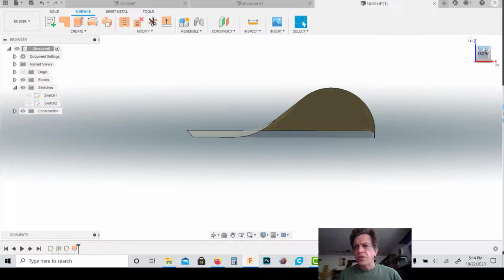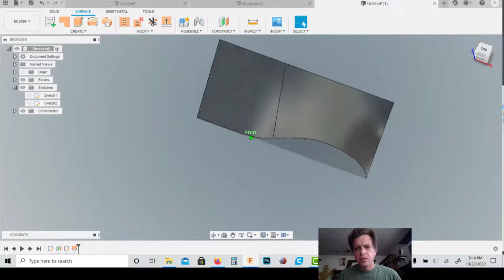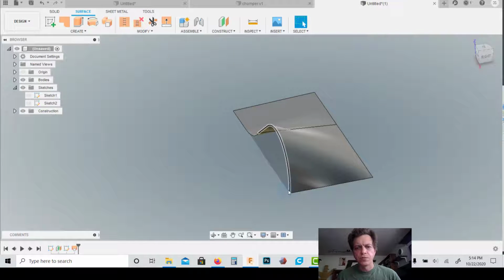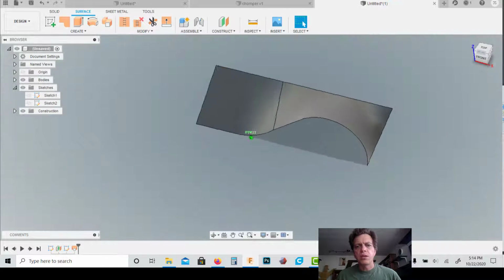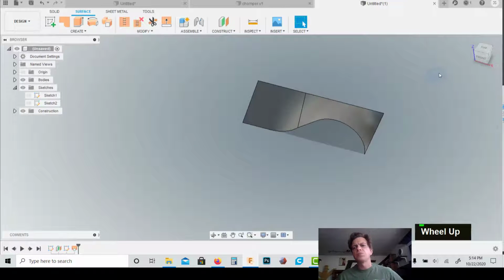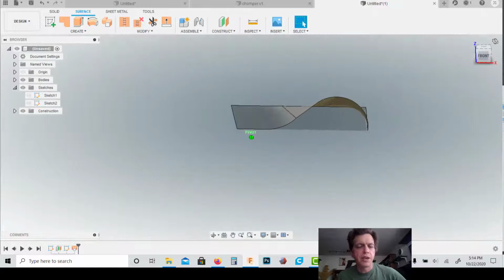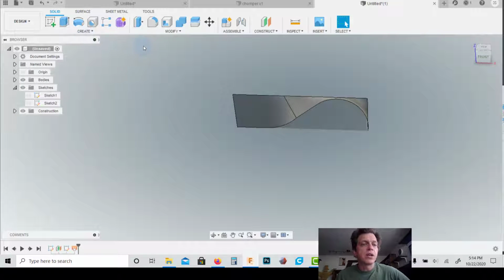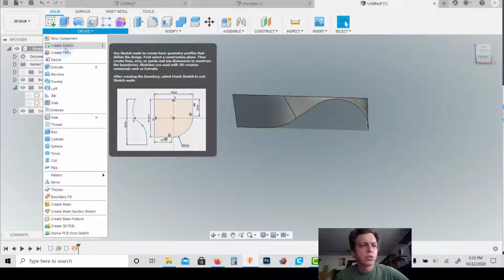So now what we have is a plane that starts with the curve that we had on one plane and a line from the other. Makes a smooth transition. This will be useful in the pumpkin assignment. So what you can use this for, aside from if this is what you wanted to design to begin with, this can be used to split bodies in half.